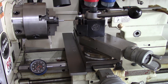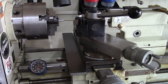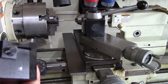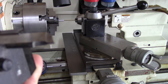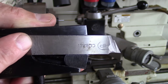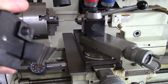My setup is pretty simple here. I have a dial indicator on a mag base so I can determine my zero and 400 thousandths for the part. An eighth-inch drill bit, and I've got a parting tool that I ground myself. I took a normal parting tool and grooved it real thin so it cuts off nice and clean. It doesn't really fit in my import parting blade holder, but it does fit in just this much right here. It's ground to exactly 25 thousandths thick, and I'm going to show you why I did it this way instead of just using a normal parting blade.